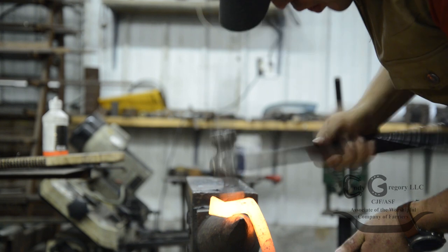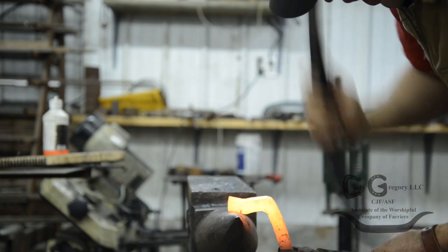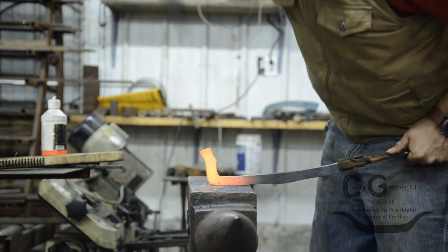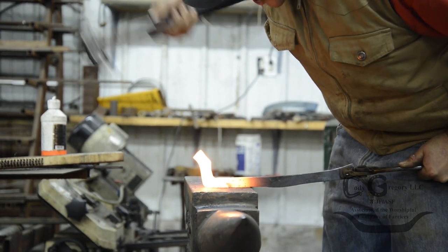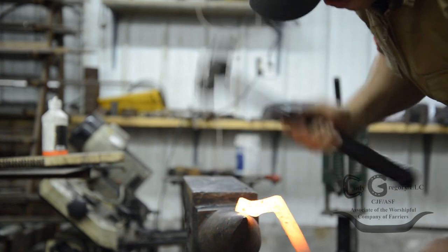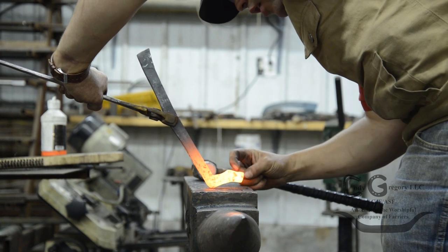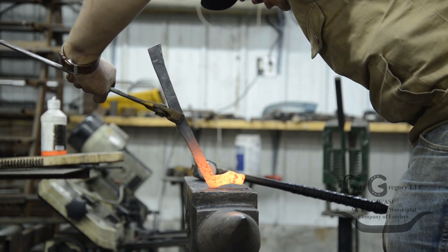When we're setting this up, we want to have that front plate slightly offset towards our lateral branch. The reason for that is when we go to weld up the branch, the extra steel from the lateral branch is going to push that section to the center. As I hit this down in the cleanup, I'm going to put a lot of angle on that end edge of the hockey stick. The reason for that is as this other branch comes in at an angle, if I can set my hockey stick up so that I can only overlap equal to that whole weld, I'll have a better shoe. This angle is important, and you can see how the offset is towards my lateral branch.